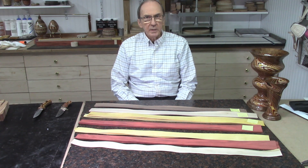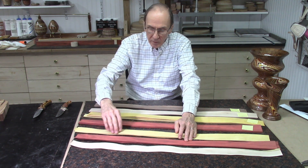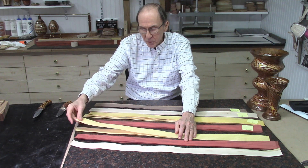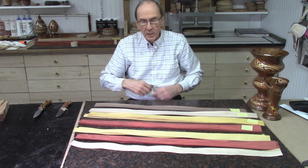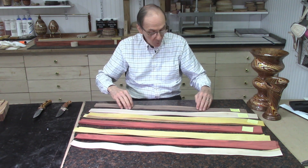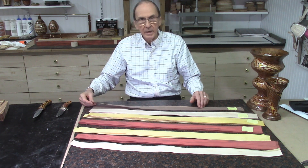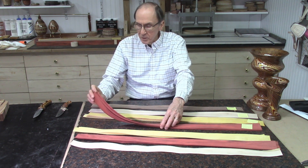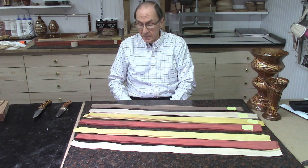The result of slicing ultra-thin boards on the AccuSlice system: I was able to cut boards ten thousandths of an inch thick and thinner. Boards at five thousandths — maple, Red Heart, and Yellow Heart — are very, very thin; I'm not sure I can even use them, as they start splitting. However, boards eight thousandths and thicker cut very nicely. The ten thousandths boards of Red Heart, Yellow Heart, Maple, and Walnut are very accurate — within one thousandth of an inch edge to edge, and within two thousandths tolerance between multiple boards cut at the same setting.